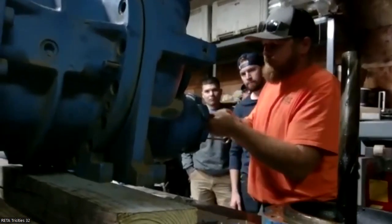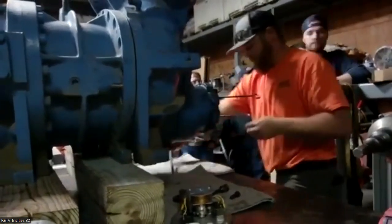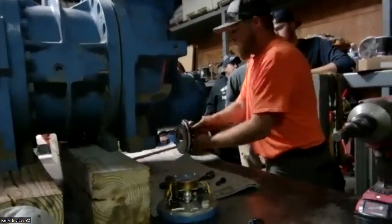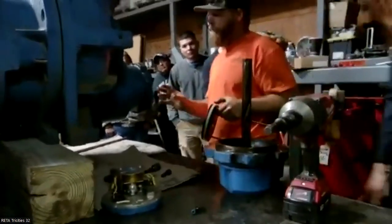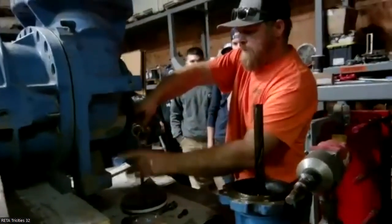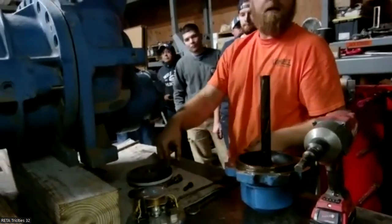Sometimes they come out easy, sometimes they don't. So this one has a cap seal that basically protects the O-ring where it rides on the cylinder here. Hydraulic pressure oil pushes that piston forward and backwards to load and unload the machine. That's another Teflon seal there. It's just a cap seal protecting. And what's the material of the O-ring inside? The O-rings, yeah, they're usually HNBR.